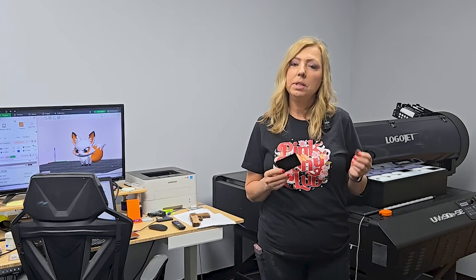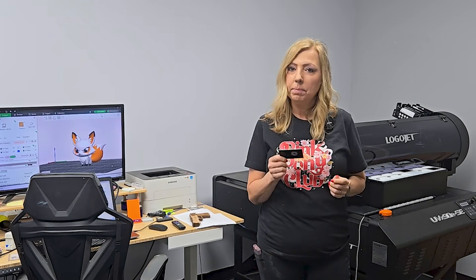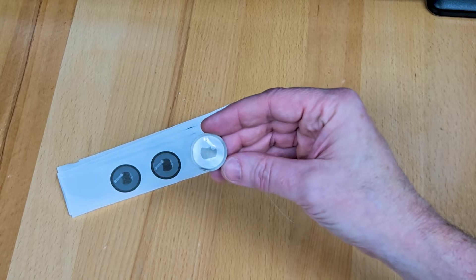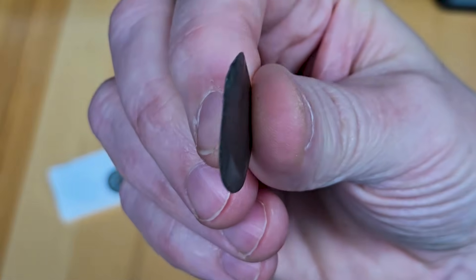Here's the challenge: with typical NFC tags, you can't just slap it on a metal business card and use it because the metal acts as a Faraday cage, which detunes the antenna. The solution is pretty simple — we're going to get special NFC tags labeled anti-metal NFC tags. These tags have a thick dark ferrite backing layer that allows you to use them on metal.